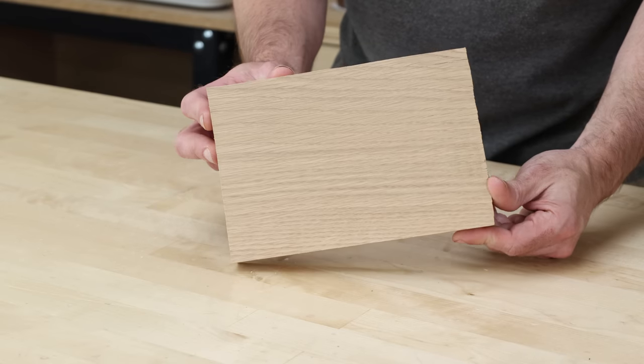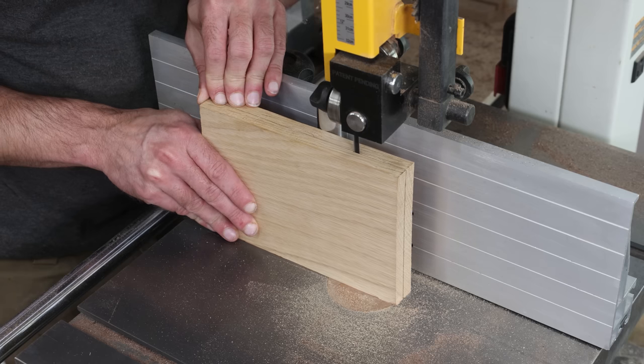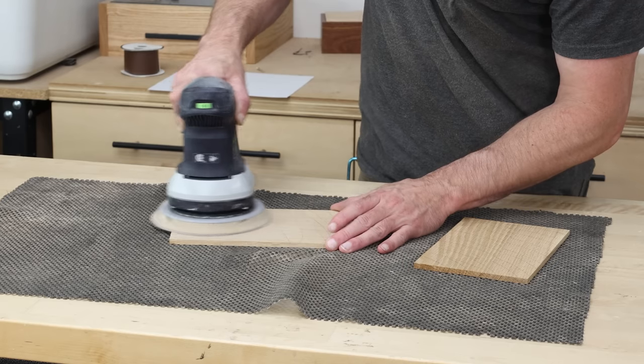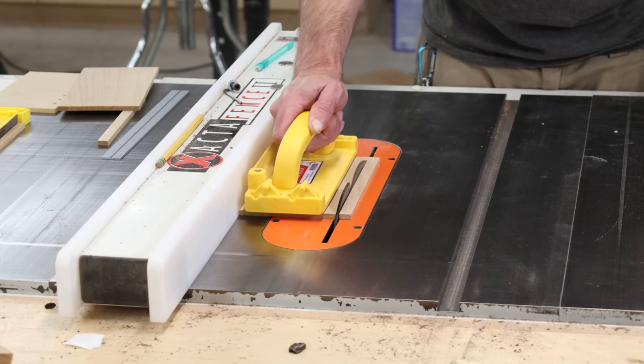I got a really nice piece of white oak here. It has all straight grain, which I think is going to be kind of cool. I'm going to take this board, rip it in half, get two boards out of it. Then I'll do some cleanup work — remove all the saw marks and all that stuff — plane it down to the size that I want, and sand it all smooth. Basically get everything ready for the next steps, which will be to turn this into the next gift idea.